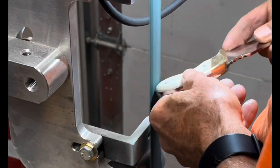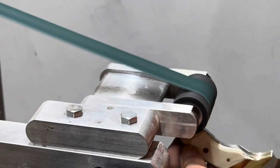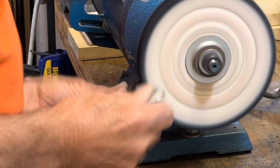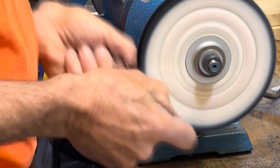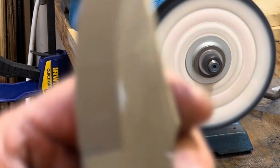These belts here are very thin — they come in a wave pattern. They're 400 grit and 600 grit, and we're using different wheels to get into the different gaps. It sounds simple to say go to a finer grit so you won't hog off material, but in reality you get dark grooves or deep cuts and scratches and have to go down to a harsher grit. When bringing it back up through all the belts and grits, you risk scarring something, overheating the blade, messing with the heat treatment, or ruining an edge. So you have to be very careful.